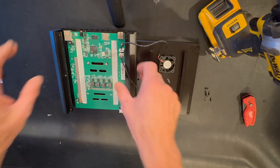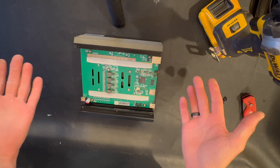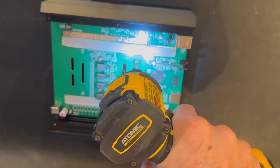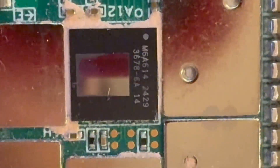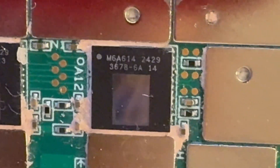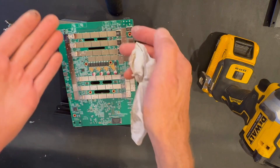Let's take it apart and see what kind of chips we have. Same fans. Disconnecting now — and the chips are 2429, guys. The Casper Ultra is 2420, I believe. So yes, 2429 — these are not the Casper chips. We can't do anything with Casper miner firmware on this; these are completely different chips. But we'll be testing and playing around to see what we can do with this unit.